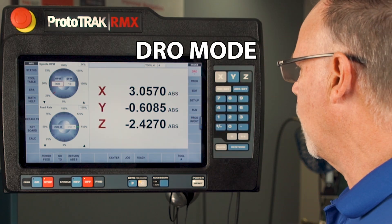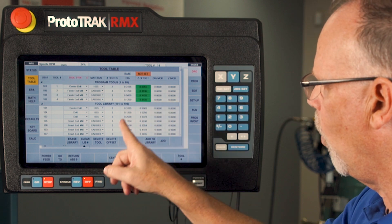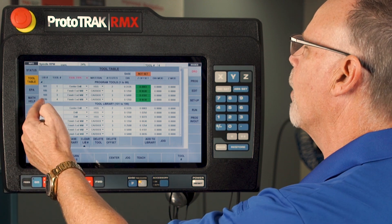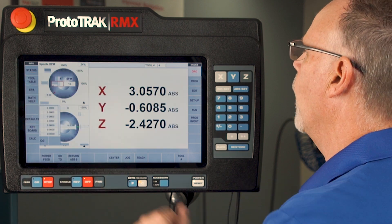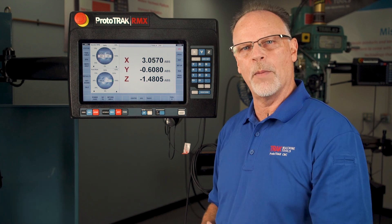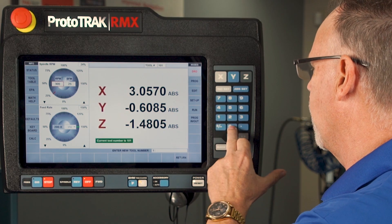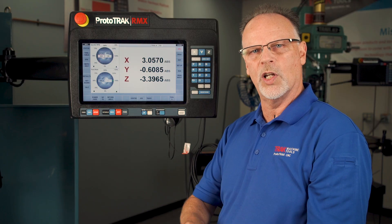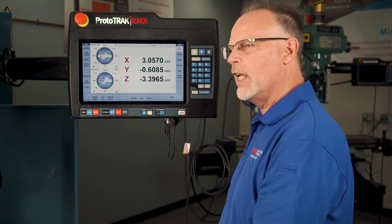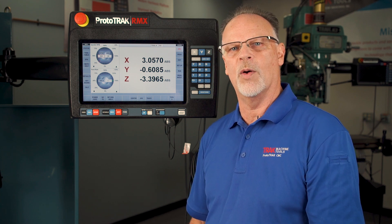Back in DRO mode, the last thing is the tool number. If I open the tool table you'll see a bunch of different tools — in my library I have numbers 101 through 107. If I close that and say I want to use tool number 101, you'll see the Z-axis change for the offset of that particular tool. When I take that tool out and put another in, I say I want to use tool number 102, and it changes that number so each tool touches the top of the part at the same zero reference. Hopefully this gives you a clearer idea of how the DRO mode works — it's a good refresher course. Thank you for watching, see you in the next video, and as always, keep on tracking!